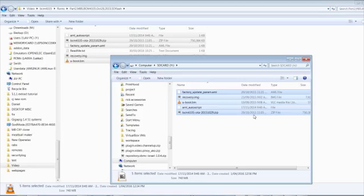Place the SD card into your powered Amlogic box. This time around we're going to do the toothpick again and connect the power cable — not the USB male connector. That's going to go through a flash cycle again and flash back your original Amlogic firmware, which will give you Bluetooth, Wi-Fi, and remote functions again. Hope you guys enjoyed it — big thanks to CJ Collins for testing this out on his Amlogic BCM4335 chipset. If you like this video, please like and subscribe and help me continue making more videos.